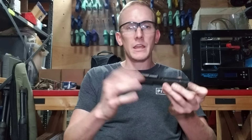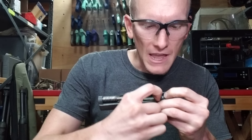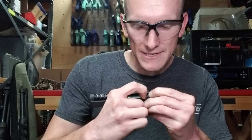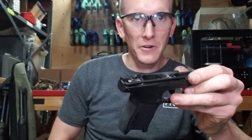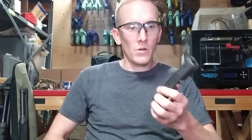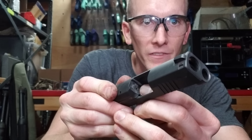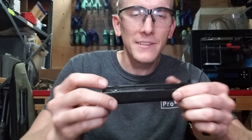In a nutshell, how you can prove that to yourself: you can line the gun up, look at where the sear is, look at where the striker is, and manually depress the firing pin safety, pushing it past, and you can see that this rear hook has to go past the trigger sear surface in order for the striker tip to protrude out through the hole in the breech face and indent the primer. That'll tell you, if you want reassurance for yourself, that that hook — that second hook in the back — does just that.